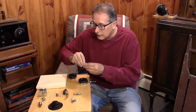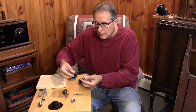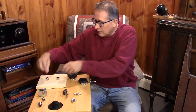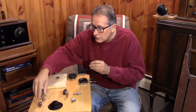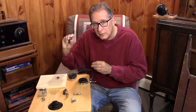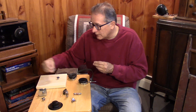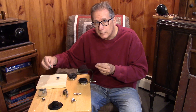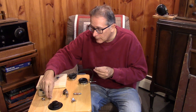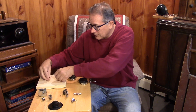You'll need a couple of tube sockets. They don't have to be anything fancy, just regular tube sockets that will stand off on the board. If you have tube sockets with a shield, go ahead and use them — shielding the regenerative stage or audio stage will improve performance and stability. But ordinary tube sockets are just fine.